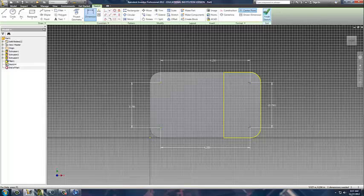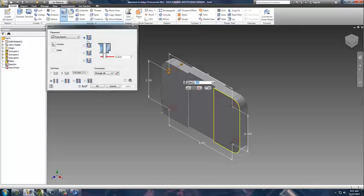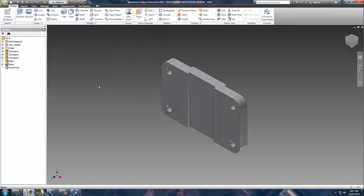I simply go to finish the sketch. I go to the hole generator under my features in the model. Click on it. It detects the center points automatically. This is generating a hole that is a through-all hole that is 0.25 in diameter. Well, in our case, these holes are supposed to be 3/8 of an inch, or 0.375, in diameter. We've got the centers marked. We don't have threads on this. We're actually completed. So if I just simply click OK, I've now completed this drawing.